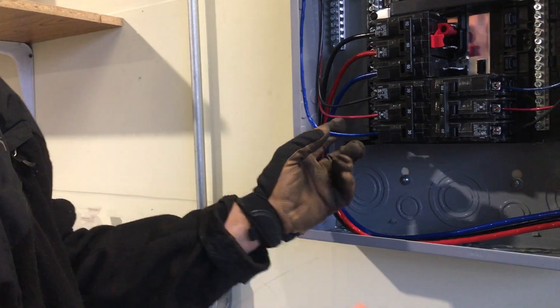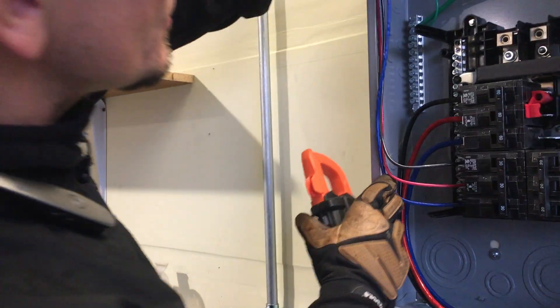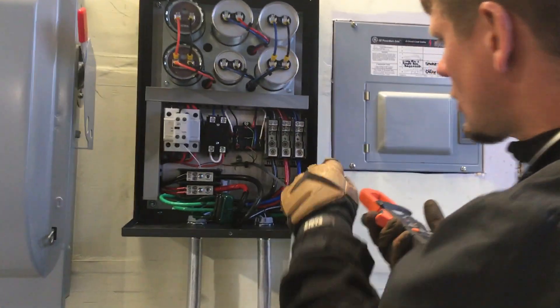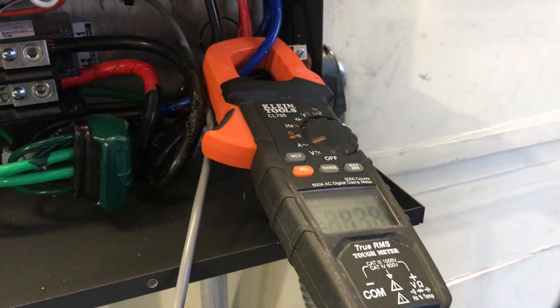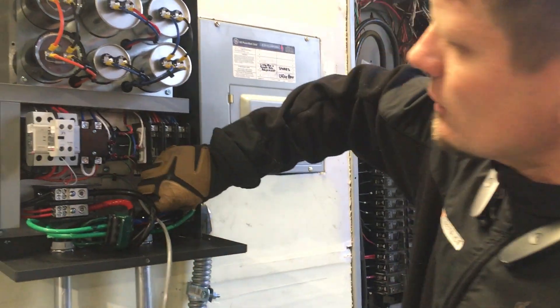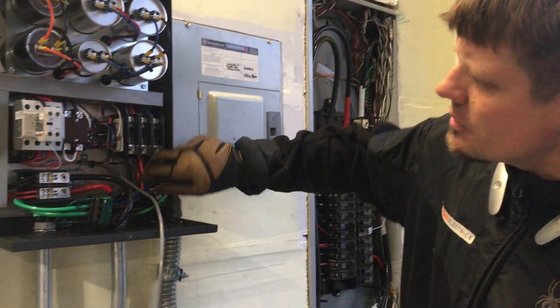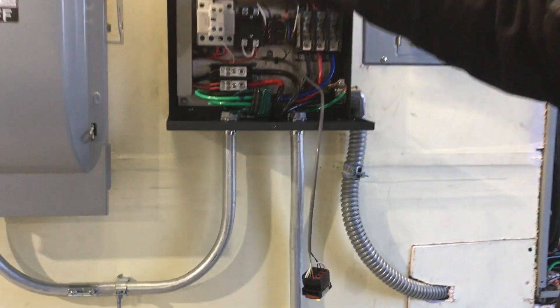Let's check the CNC — let's see what it's truly drawing. On the CNC: three amps — they were correct, not drawing a lot — yet I'm wiring it as a 30-amp circuit based on the nameplate specs. On the converter itself, it's drawing about 4.3 amps on the higher leg. On the lower voltage leg, amperage goes up a little, close to 5 amps. So it's very, very minimal draw. The converter uses a double-lug system — it almost Y's out, going to the disconnect and to the converter, and back up through the capacitors.